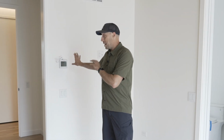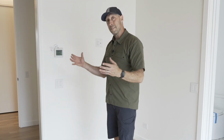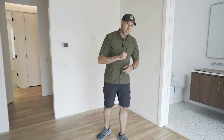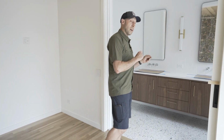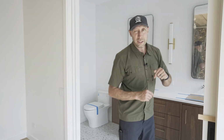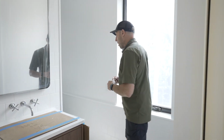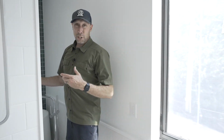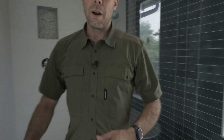But you can imagine the importance of providing comfort to your homeowner. You really want that point of connection right where it's going to be sensed by the occupant and the thermostat, same space. Also, we want to talk about moisture load. And this is something that we can talk about more on the east side as well. But here in the primary suite, we have, well, obviously your double vanity that everybody has anymore, but we also have sort of a large shower and a bathtub. You can imagine the amount of water that we're running out of 3 different shower heads.